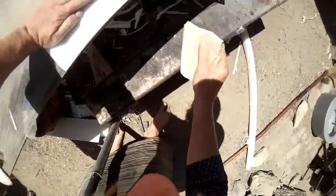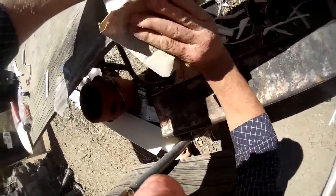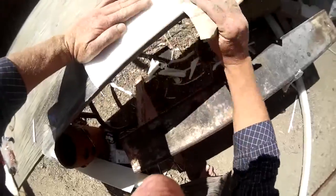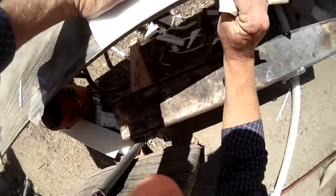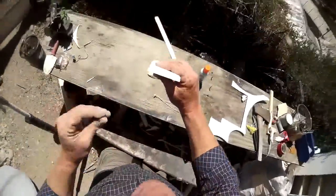Put it on the edge like this and start sanding it into a round curve. No sanding block — I like to use my hand on a piece of paper; I get a better feel for it and can wrap it around the curve. Just take your time and sand it down. You round the edge right down to the hard edge. You can see the line starting to form between the two sections. Concentrate your sanding on the lowest spots of the line, or the spots most forward toward the leading edge, to get it straight.